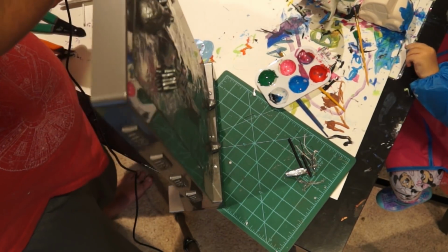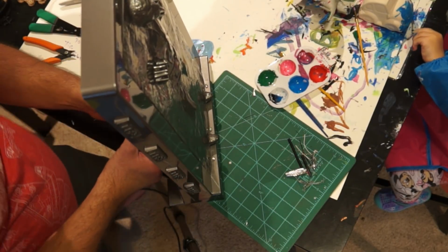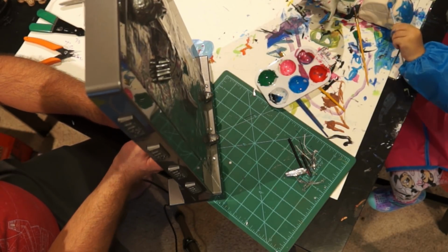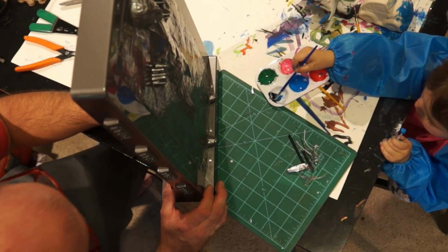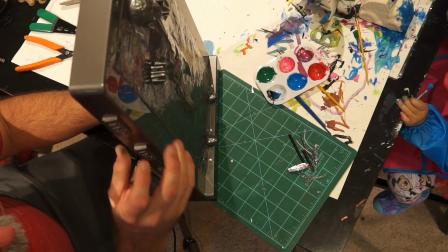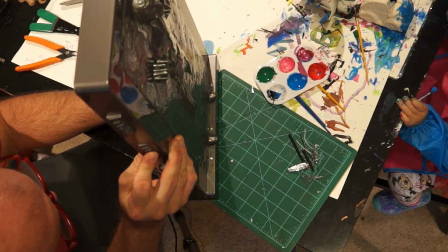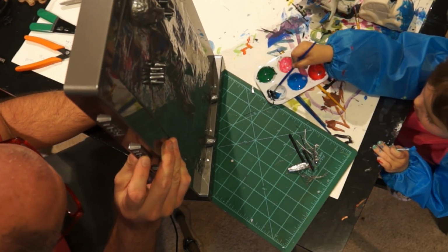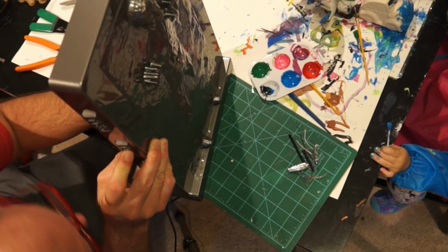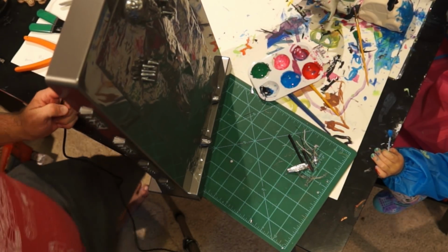I know it's got a good power supply, because I have used it to charge a PlayStation 4 controller. Might be too high of a resistor too, or I could have burned the thing out with a wall wart. Okay, let me check something. It's not coming on, so I need to check and make sure we got voltage and all sorts of other stuff. I'll be back in a little bit.